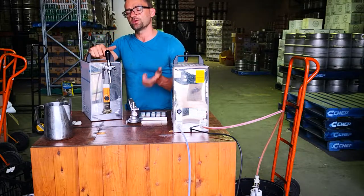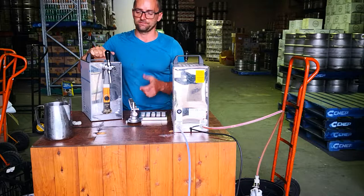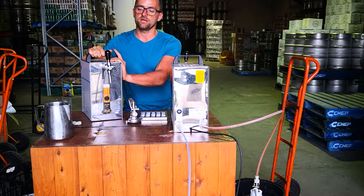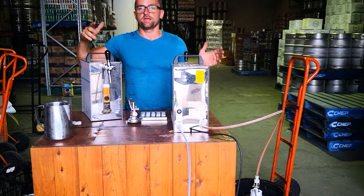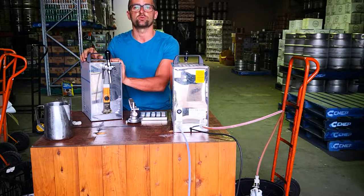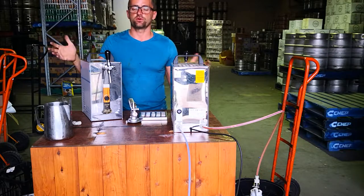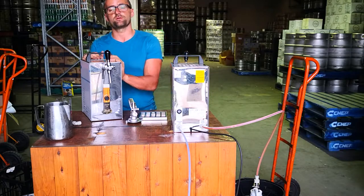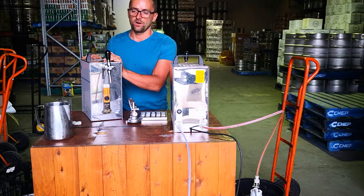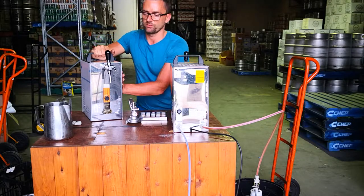We are selling European beers, so the foam is the sign that the beers are living - not dead and flat like Australian beers. So the foam is a natural thing. This unit can cool about 25 liters an hour. It doesn't mean that if you pour 10 liters in the first 5 minutes you're going to get nice cold beer - it will be probably slightly warmer and will cause more foaming. So it's important to keep to those intervals. 25 liters is basically almost one keg; a 30-liter keg would be one hour and 10 minutes. If you get 50 liters, it would be a range of 2 hours, which is quite decent for a small machine.